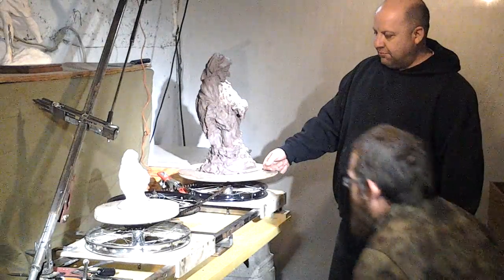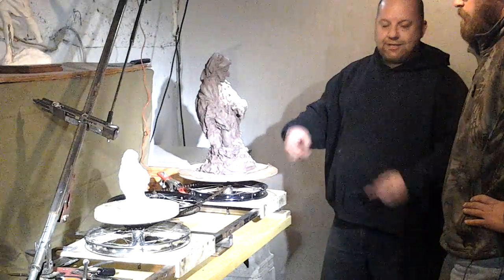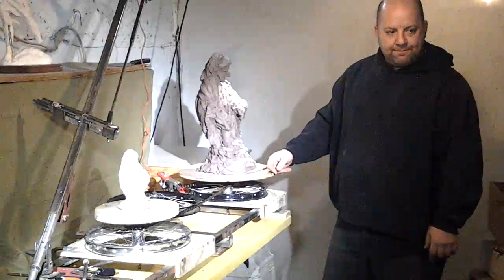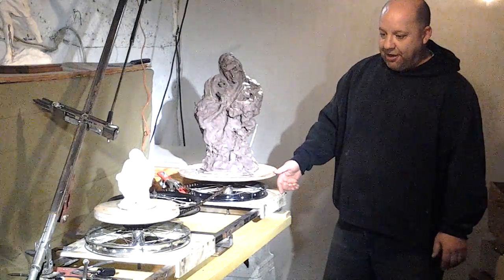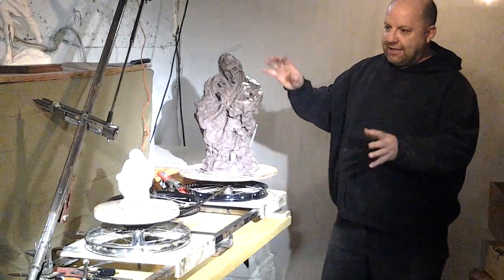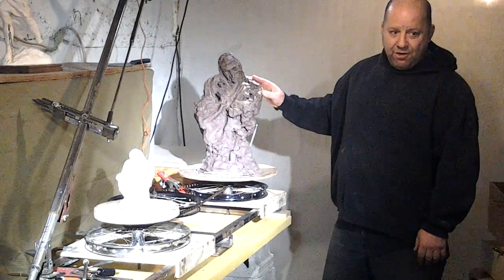This one is just to keep the chain tight, because if you don't have the chain tight then it slips off the gears. It's not running vertically like on a bike, so there's nothing there to keep it on except for the tension - gravity's not going to hold it right onto the sprockets. But it turned out really cool. I know exactly how I would build another one now, and I'll probably film that whole process. Eventually, probably after I get this sculpture done, I'm going to take this apart and show each and every piece. I might even draw out some diagrams for future reference, because nobody has it - nobody's drawn diagrams.